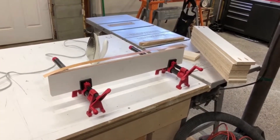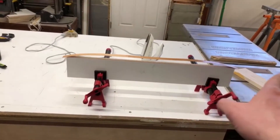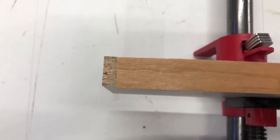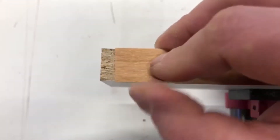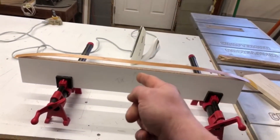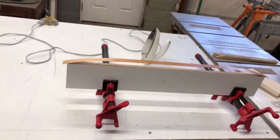Open the door — peekaboo walnut and melamine. Look at that, nice and clean. Blum hinges, adjustable shelves. Okay, let's get to the how-to part. What you want to do is cut your edge banding a little longer than your work piece. My work piece is 26 inches — I cut the edge banding at 27 and a half or so. Now look: I'm going to slide this back so you can see how the edge banding is a little bit wider than the particleboard. That's what you want — center that edge banding on there so you have a little bit hanging over on each edge.